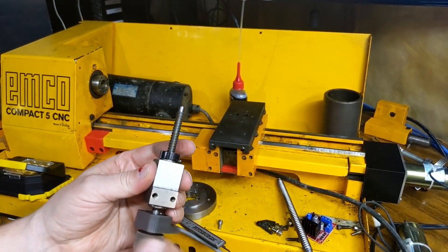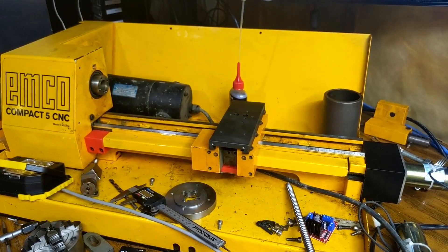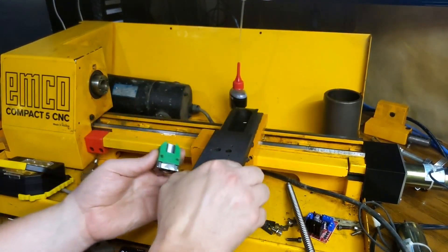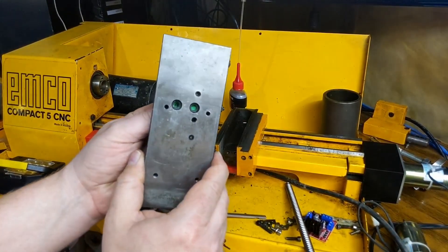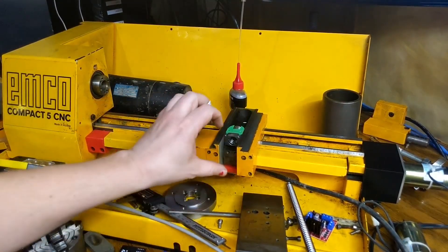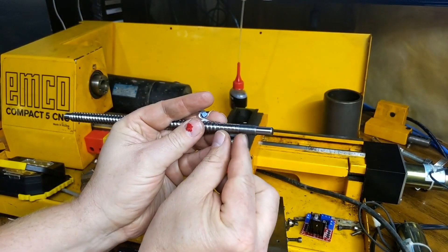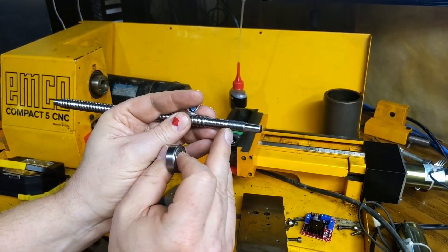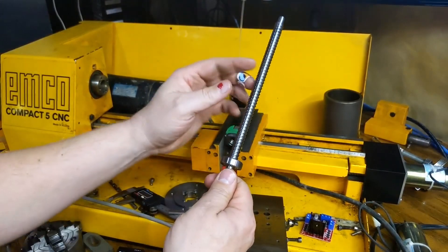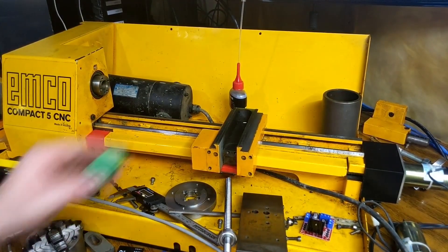You can't preload them very much otherwise I think they destroy themselves. So going with like a C7 — or whatever this is — I'm mocking up the X axis. This will be made in steel, bolted to where the other one was, and it just fits in there. I'll make another assembly to hold the bearings for the end. I might shorten the threads because I only need them long enough to preload the bearings — this thread is a bit too long as you can see. So far so good, I think I can make that fit.